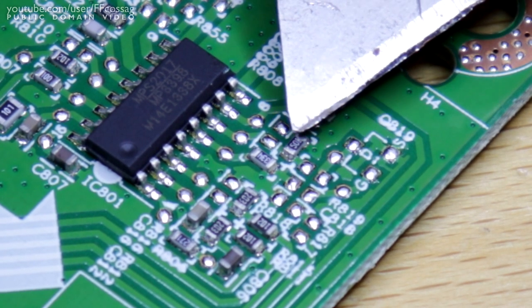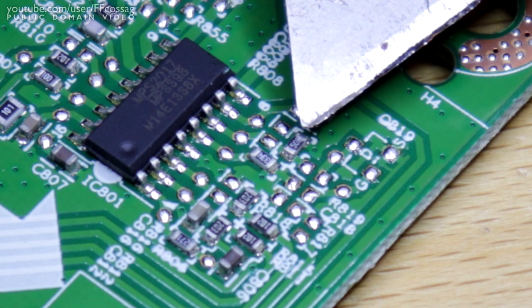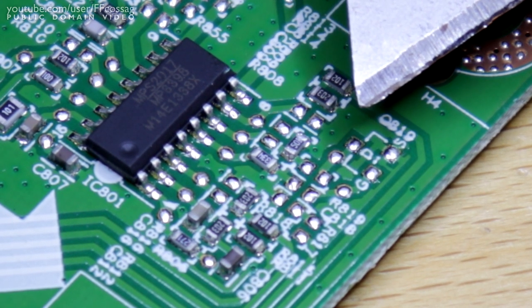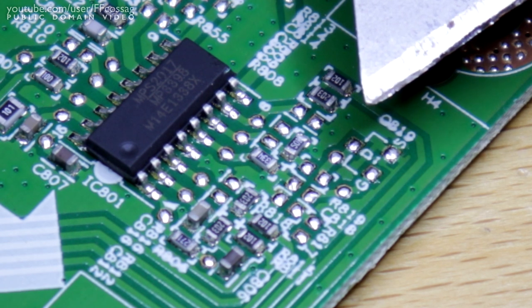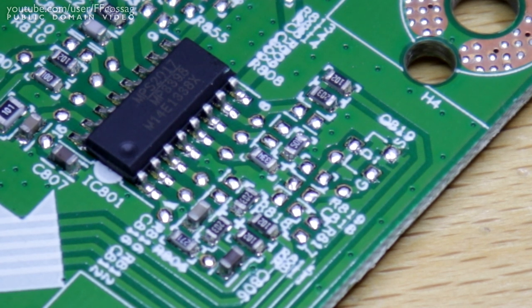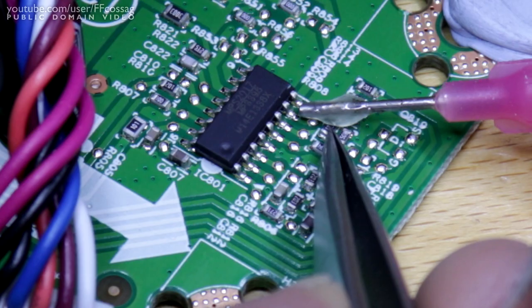So I think we're going to experiment a couple of times, probably. I want like maybe a quarter of the brightness we can get out of this thing, maybe even a bit less. So we're going to be going for something like 10K maybe. That would give us about 100 milliamps, which is just a third. So we can really go even further, 12K. 12K is 80 milliamps. That sounds about right. So let's shoot for that and see what happens.